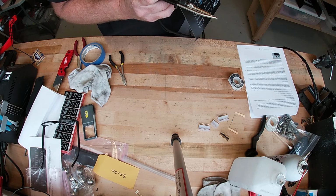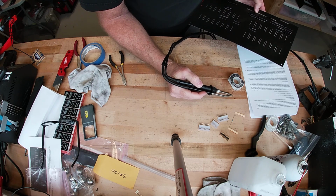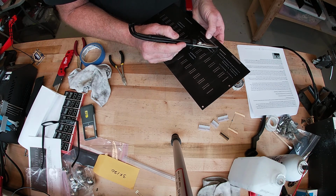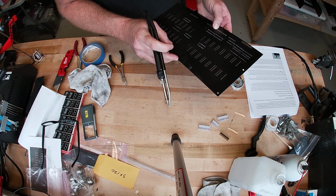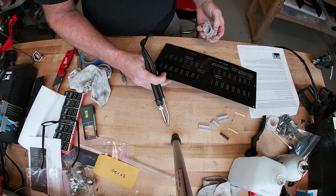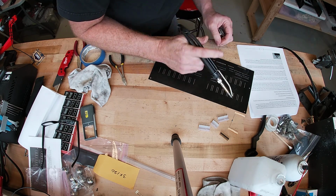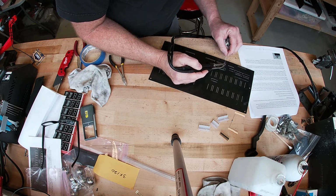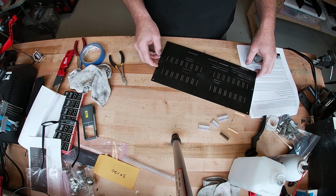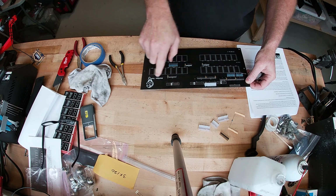Of course, you got to be careful that you're not touching the metal, because you don't want to burn yourself. But as you're holding it, or if it's tight enough just sitting there, you can put one pin on, enough solder to make a connection, and then when that solder sets, the plug will be tight, and you can go do the rest of the pins and not have to worry about it moving. And these are actually trimmed right, so they don't need to be trimmed afterwards. So now I got a nice solid connection, and we'll finish up all the other white connectors and then move on.